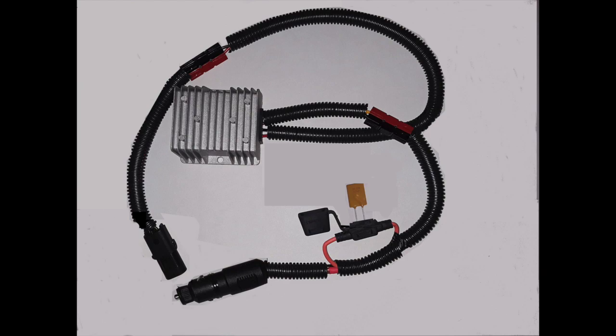Initial testing showed that I never again had a short circuit condition. But there were two problems that I noticed that made it less than ideal. The current was, on average, noticeably less than what it had been without the PTC. And when it reset, it took a very long time to reset due to excessive heat generated by the PTC.